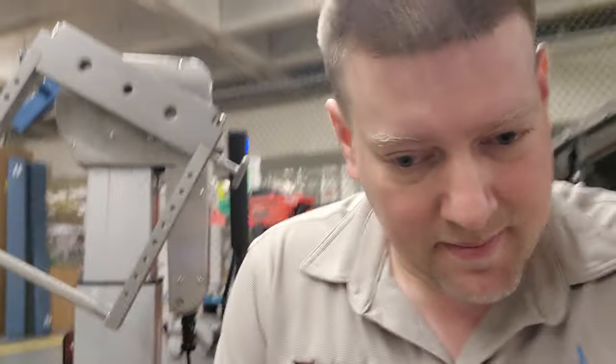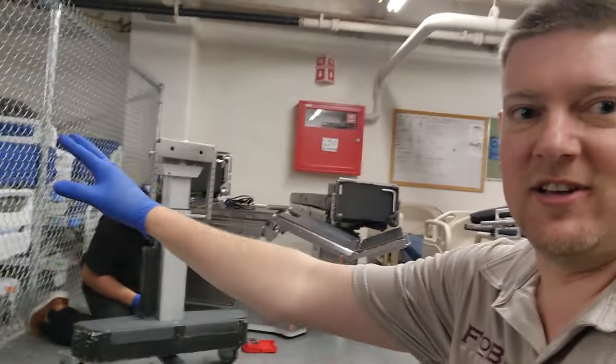We're going to open it up and do an inspection. During table PMs, if you don't have a battery change sticker on the outside, open it up, check the hydraulics to make sure it's okay, and make sure the batteries are within the last two years. If they're not, you're getting the last year's worth of life out of that battery and you need to budget for a replacement — some of these tables have very expensive batteries. We have a whole selection of surgical tables to work on today. This is one of the services we offer at FOBI: on-site repairs and PMs of surgical tables, and we're pretty good at it.